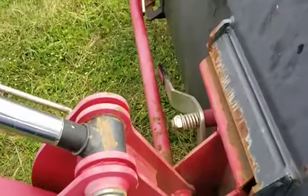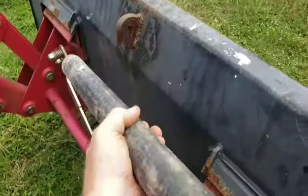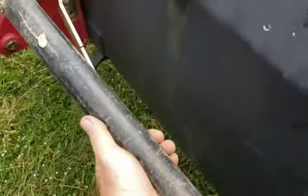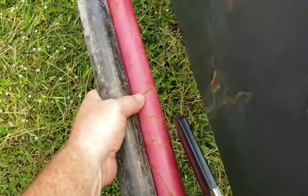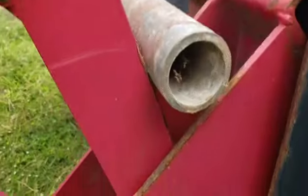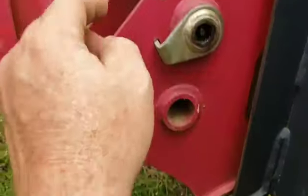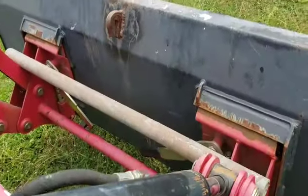All right, so looks like I've got an option here. I've got a couple pieces of this smaller pipe here, and it's probably 1/8 inch versus the 1/4 inch that is through there and across. I can split this piece in half and then cut it here and then weld this on, and it would help. Or I can take this piece, that's a good solid piece, and use the gas hatchet and cut this out, cut that out, cut that out, pull that piece out. Never comes out that easy. But then I could put it in as one piece.